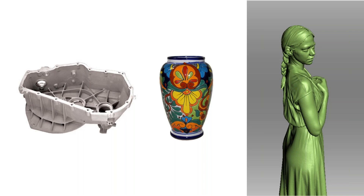If you work consistently with objects that are geometrically rich — like cast housings with all these ribs, pockets, bosses and other features — a self-tracking scanner could be a really practical choice. In a past webinar we discussed how the limitations of these scanners can be overcome with various workarounds. I'd encourage you to check out the Hawkridge Resource Center on the Hawkridge website. But they are exactly that — workarounds that require some added effort and additional knowledge of how the scanner works. In the end, they're generally not going to be as reliable as a technology that integrates a dedicated solution for this problem into their core technology.